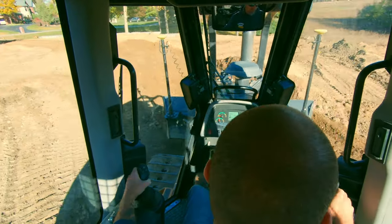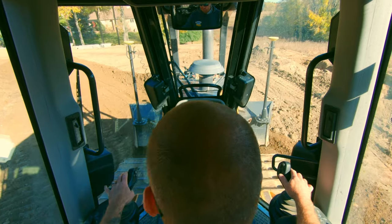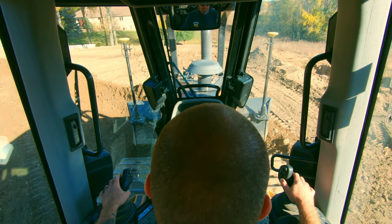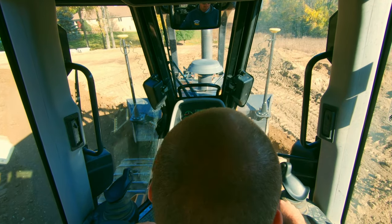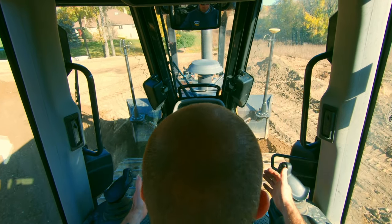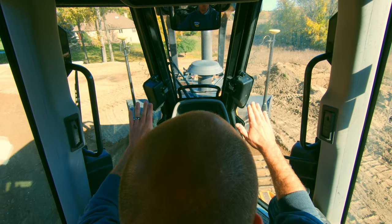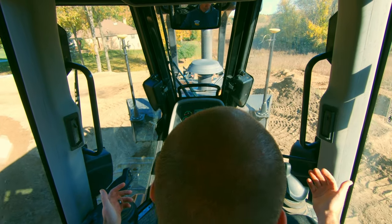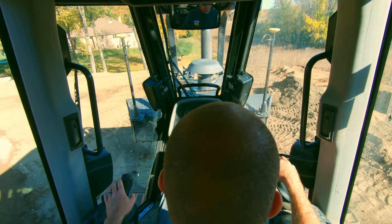Likewise, let's say we want to go slightly uphill — I get some dirt loaded on the blade and cat forward. What happens is my tracks are going up, which means the blade goes up too, the angle slowly increases, and next thing you know you're headed for the moon. So it takes constant adjustment of the dozer blade in order to run the machine properly.